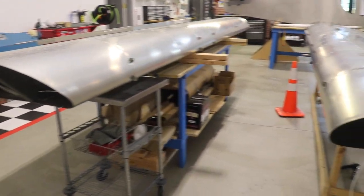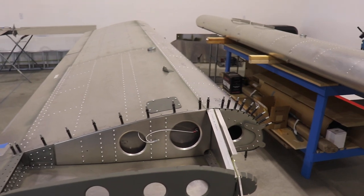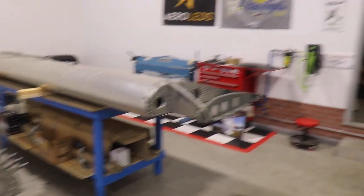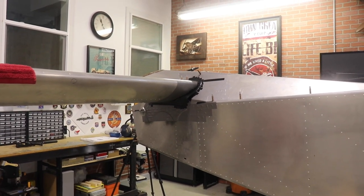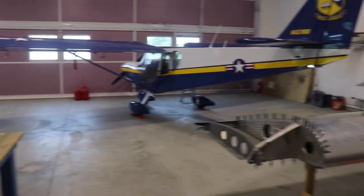It's not really important I get this done right now, but I do still have to fit the plastic wing tips to the wings. There's nothing else I need to do on the wings to get them attached to the fuselage. The wing struts are under that workbench — I can dig those out and start getting those prepped. But the next step is to get this fiberglass fairing done on the back, which we're going to do on Tuesday. Once that's done, I can pop those off, get the fuselage all leveled and secured to the floor, then get a bunch of people together and get these wings rigged. The point of attaching the wings now is to get the wing struts cut, drilled, fit, and have everything rigged. Then all of it comes back off, which lets me get the wing struts painted, the wings painted, and the fuselage painted. Once everything's been assembled and fit, it's just a matter of bolting it back together.